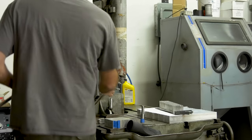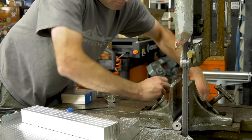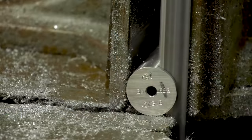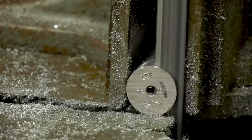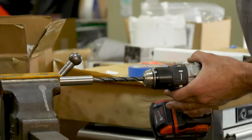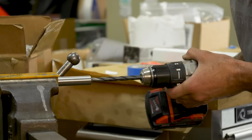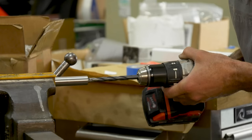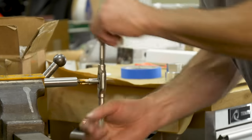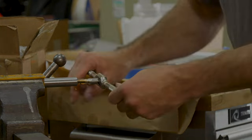To get started, we took the barrel over to this massive ancient bandsaw — made in like the 1950s — and went ahead and cut off the stamp on the end, basically giving a nice clean surface to work on. Next, which was pretty crazy to see, was him threading the muzzle — not the outside, but the inside — using a drill and then actually putting some threads in there. While it seems totally unconventional, it'll make sense later.